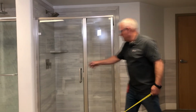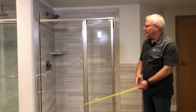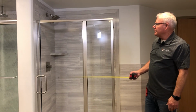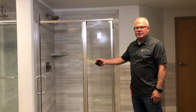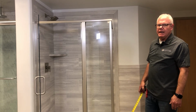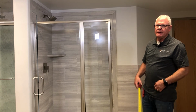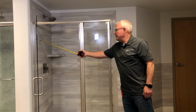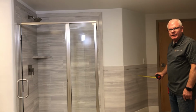As you can see, this is a sim tile look, and it looks so real because we've shaded one partial edge of the grout line, and we always indicate which way is up, and you'll want to follow that religiously because you want the effect of a little shadow on the top edge of that grout line. And the wainscot, if that's what you like.